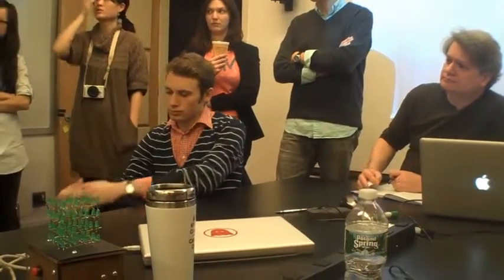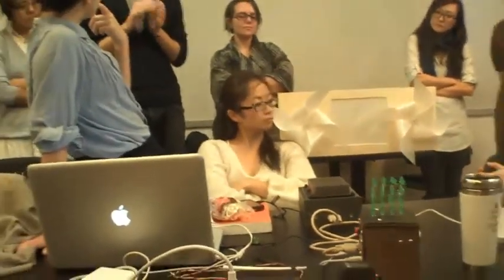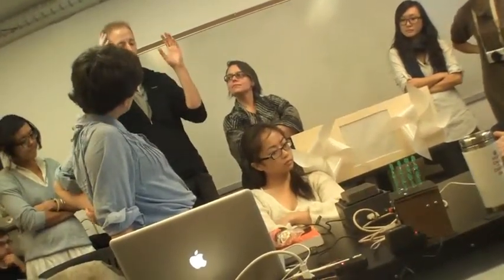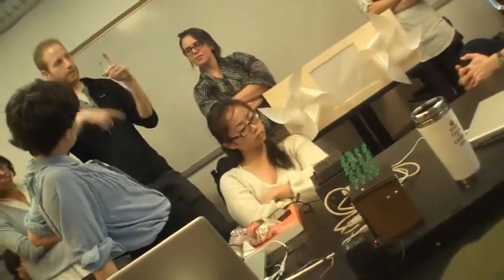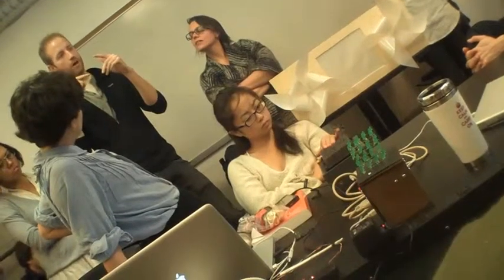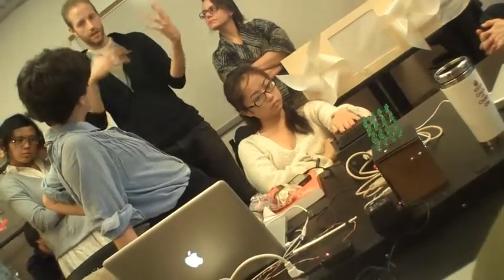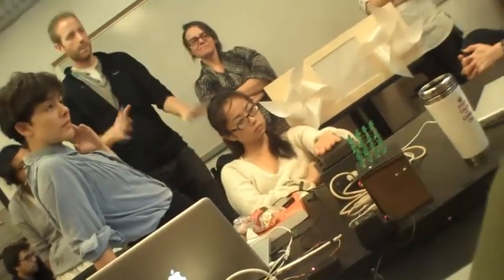And one last thing also about the code. When we were struggling to get everything to light up and match the sensors, we would turn them on and then all of them would light up, or some of them would skip and light up. So for each call that we did as we mapped out which sensor it would be, we had a function that was like write this number to our LED loop. But if not, take that same number and write it to 0, because it was on or off. Instead of just not calling it again, we had to turn it on and then turn it off, because in the loop it would get all kind of crazy and just all light up, which was really pretty, but it did not look controlled.